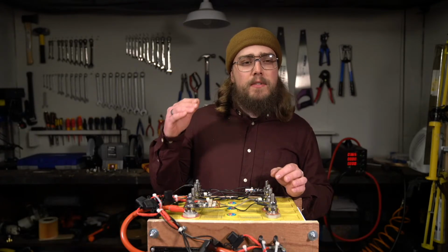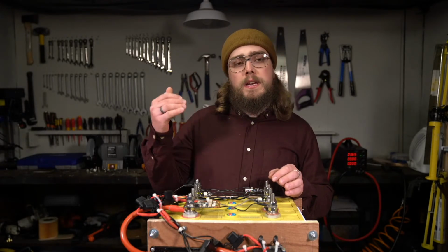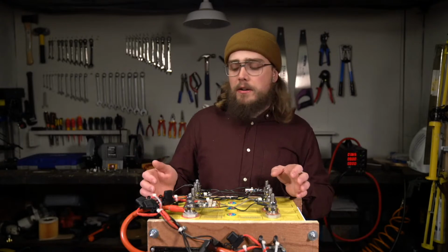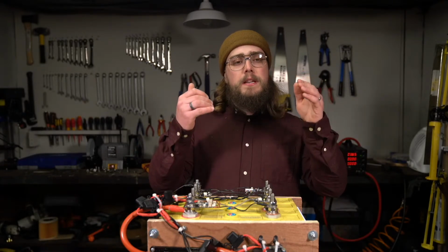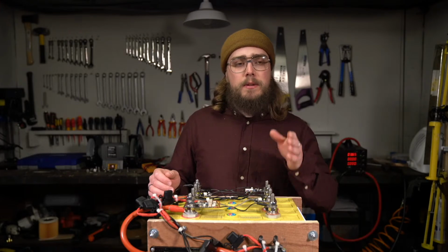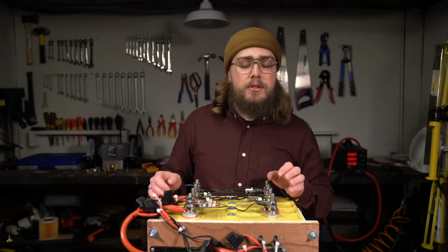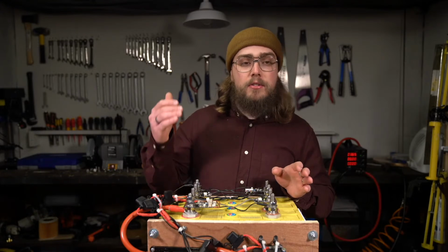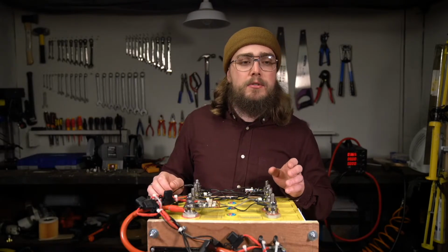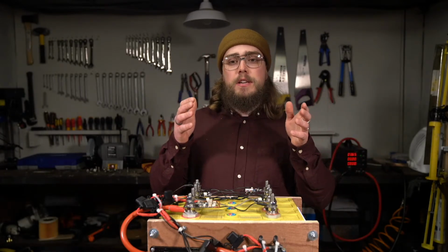And that's also considering that I have quite a high threshold in my BMS in terms of when it stops the battery from being discharged, just because I want to get the longest life that I can out of these cells. We've spoken about it on previous videos, but the beauty with lithium iron phosphate is you don't have memory like you do with lead acid or gel. With lead acid or gel, if you discharge it below 50%, that battery is pretty much toast. Like you could never use it again. I mean, you can, but the capacity of the battery once you've gone below that 50% threshold with lead acid or gel is way reduced. Whereas with lithium iron phosphate, you can pretty much use the full charge cycle of the battery.